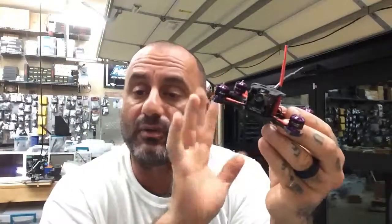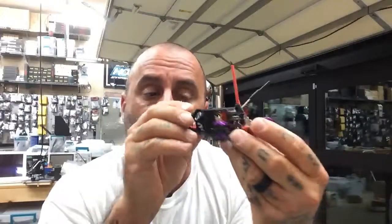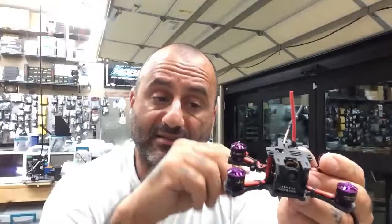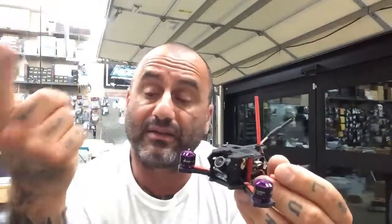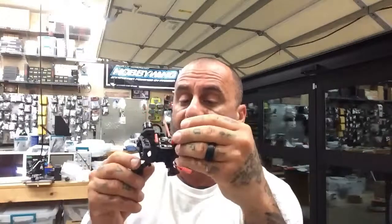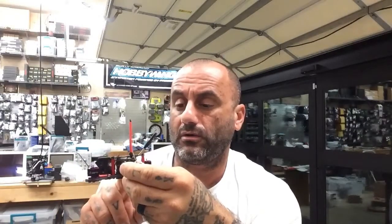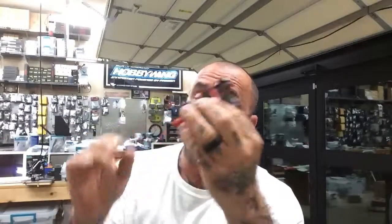That's the end of the building process. If you've made it this far, you have succeeded in your DIY kit and I'm very proud of you — these smaller quads are not easy and the soldering has to be up there. Now what we have to do next: load Betaflight, do the firmware update, calibrate our motors — you can go back to DShot if you want but I'm going to use OneShot to calibrate using BLHeli. Then I'll show you how to configure your transmitter to work with the receiver, how to bind it, set your limits, get the OSD set, and take it for a test run. Make sure to watch the next video.